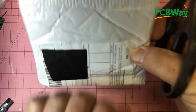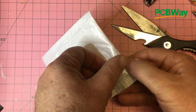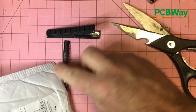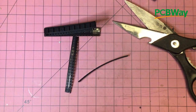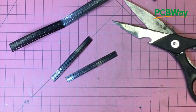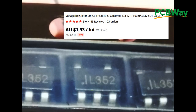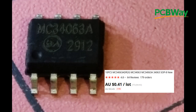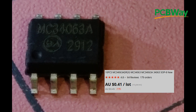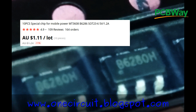Let's start on the packages now — hopefully unlike last time I've got some sharp scissors this time. First up there's the SPX3819, a 3.3-volt low-dropout low-noise regulator at 500 milliamps — could be useful. This looks like a real fun chip: it's a monolithic buck-boost chip, 3 to 40 volts input and adjustable output to 1.5 amps — pretty impressive. And this is an MT3608; we've seen this before — just replacement chips for the fried Padauk ones.